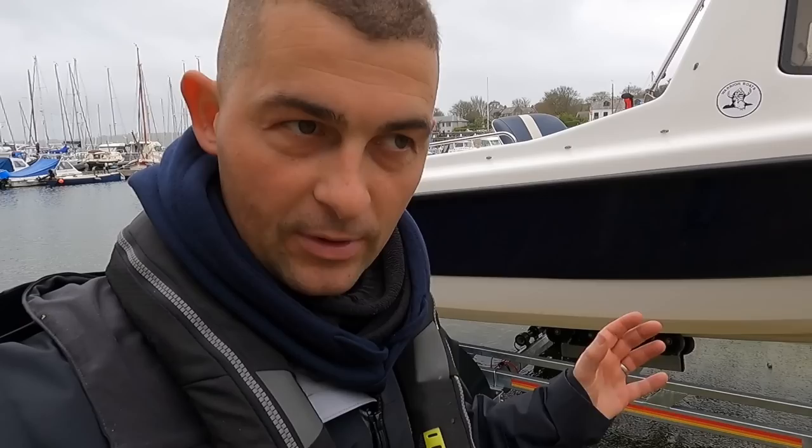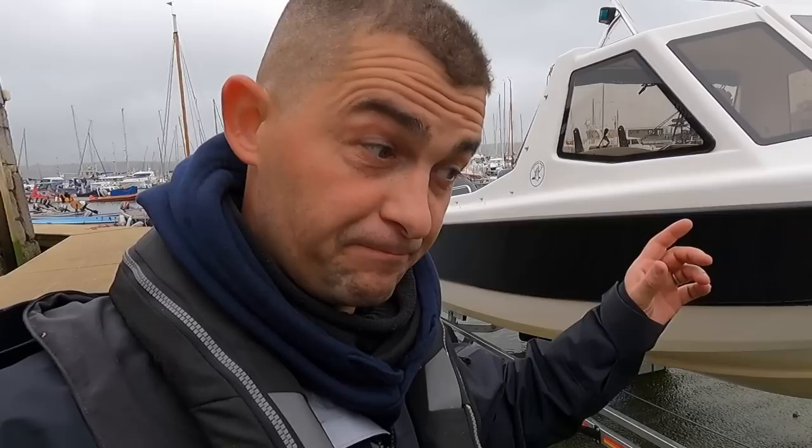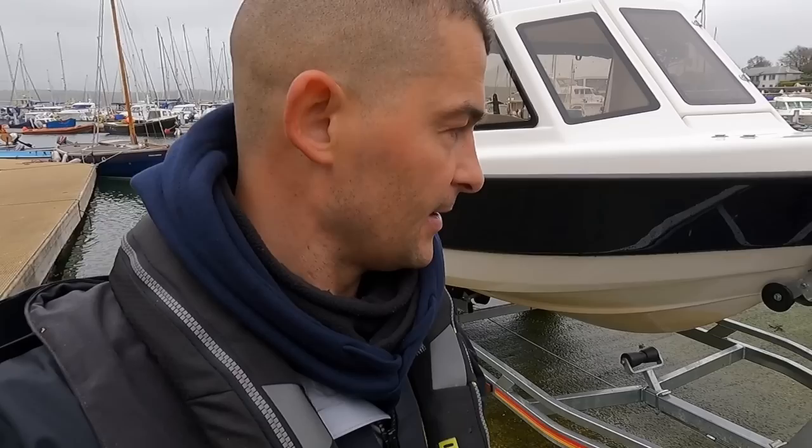The other way you could have done it without putting the boat in and out repeatedly is to get some boards and use a bottle jack or trolley jack to jack the boat up and move the trailer around. The trailer I had before was a 1500. Mine's a Warrior 170 — 17 foot with an 80 on the back. If you've got a 175 or anything slightly larger you're going to want a 1600; if you've got a Warrior 150 you're probably better off with a 1500. I'll tag some links for the SPS website in the description — the best thing you can do is speak to them like I did, because I said this is the size of boat I've got. So it took a little bit of fun angling but we got there in the end. See you later.